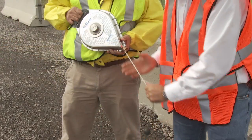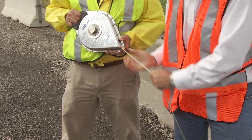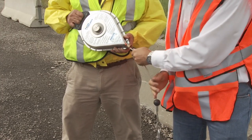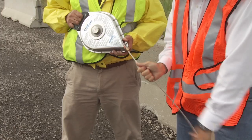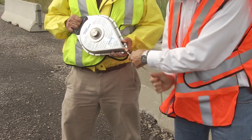The other thing you want to do — every six months — is pull out 50% of the cable, inspect it, let it go back into the housing, then pull out 100%, same thing, with gloves on, and make sure it goes back into the housing properly.